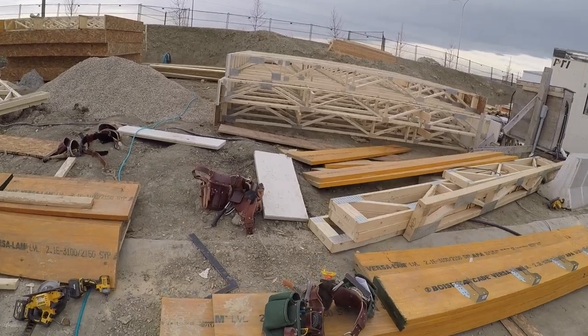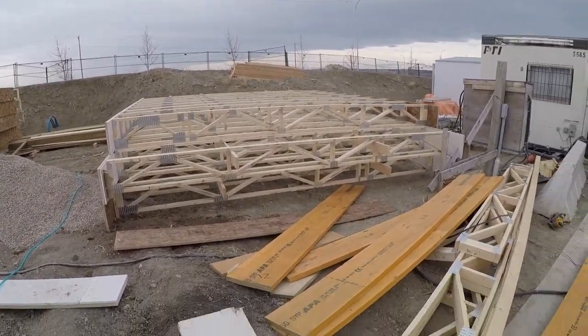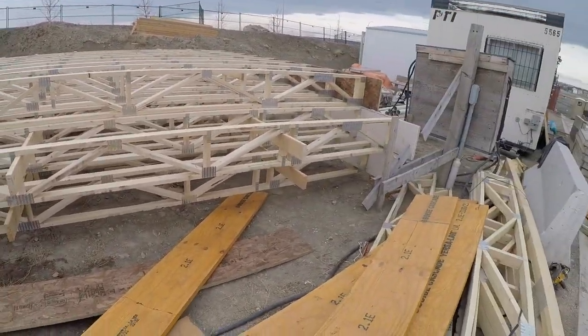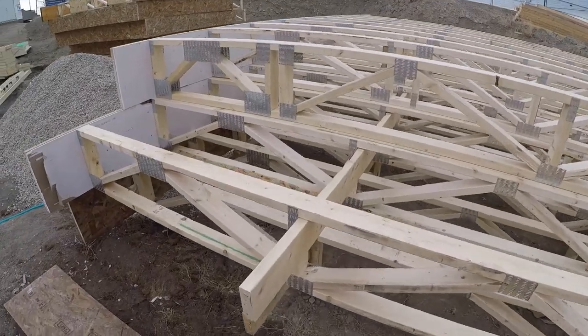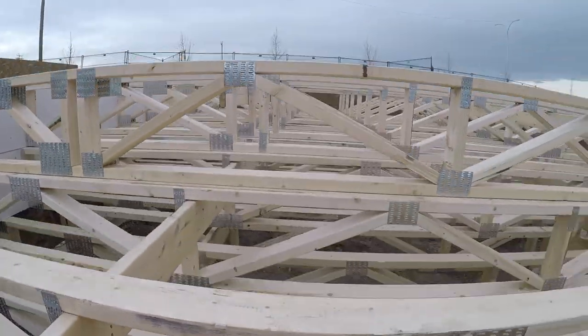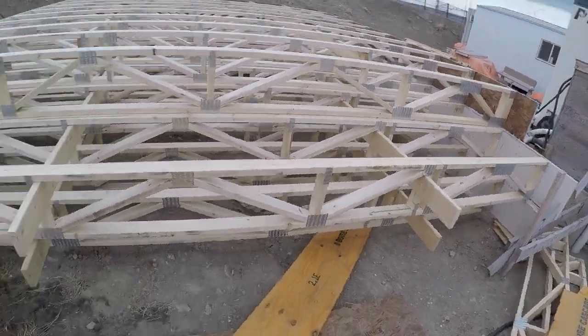There's our stack of our 18 foot units. It only calls for one strong back, but just for lifting, I'm putting two in there. Strong back, if you don't know what that means, that's this 2x6 guy running all the way through there, nailed to every single one. So when I lift up on him, he's gonna bring up all of them together. Let's climb up here.